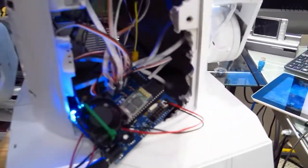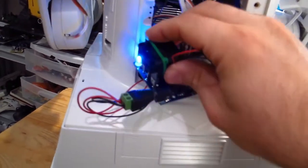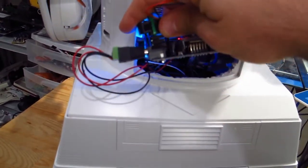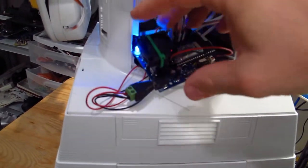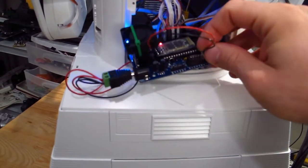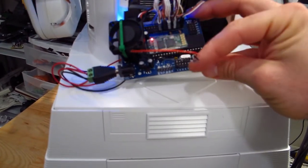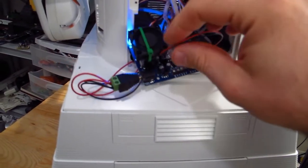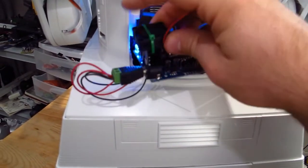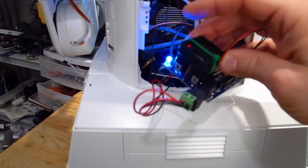What I've done — I'll show you this — is I've added a fan to the top of the heat sinks for the voltage regulators on the EZB. It's a plus-five fan from a power supply or CPU from a computer. This plug here is the plug that came with the fan. I just hooked it up to the plus-five on the board, used a zip tie to attach it to the heat sink, and it's spinning and keeping those voltage regulators cool.